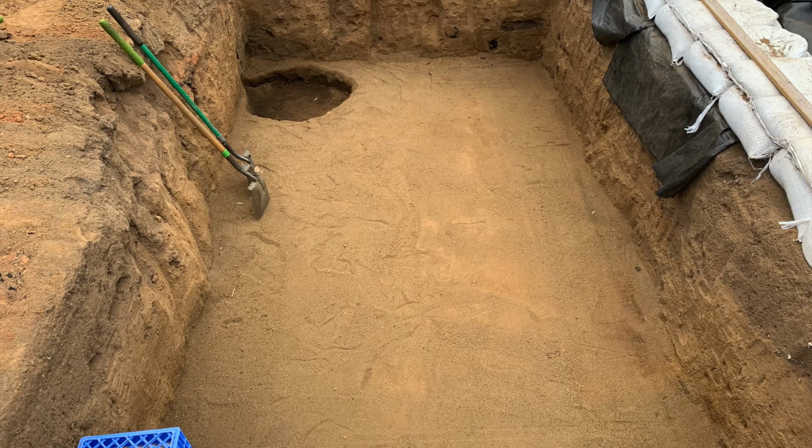And this is the final excavation. Once the crates have been removed and the base, which is mostly sand, has been screeded flat with a 4-foot torpedo level. And then you'll see up in the top left corner, there is a 6-inch deep by 30-inch wide pit. That is where my large diameter, 24-inch diameter pump vault will live. And it'll sit down below the base of the crates, the aqua blocks, whatever you want to call them, or milk crates, which will make sure that when the pumps are in there, they are at the very lowest point in the cistern, so that no matter how low water gets, they won't die until I've neglected it so long that the cistern is completely empty.